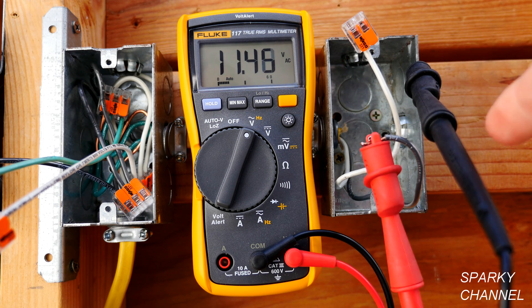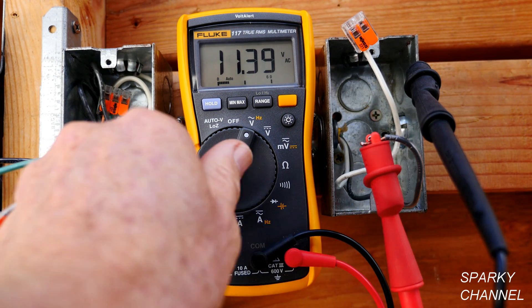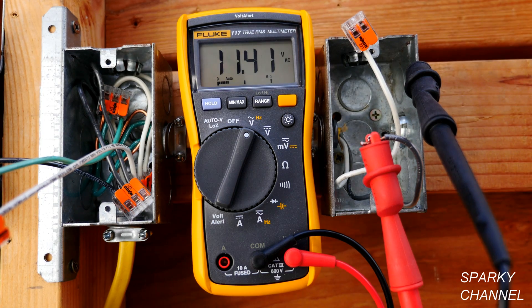In order to demonstrate that, I had to have it in the high impedance setting. If I would have put it in a low impedance setting it just would have read zero. The metal box does provide a tiny bit of ground, as you can see in the more sensitive setting.